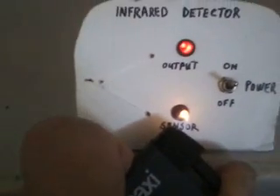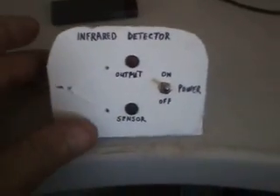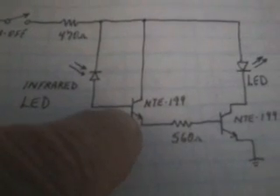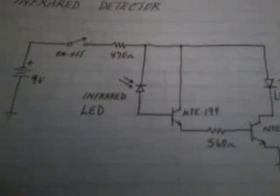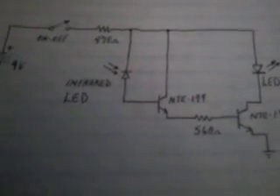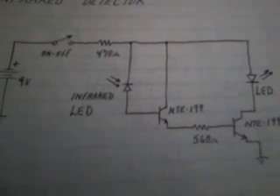I'm very, very close to the sensor, and you can see the light coming on. And there it goes out. So it actually even detects infrared light from a fire, but you have to get up very close. I can increase the sensitivity of this thing — I just have to put an amplifier between the infrared sensor and the base of the driver. But I don't want to, because this thing is sufficient enough to detect infrared light sources up to about five feet. That's all I need. I don't really want to detect fires — fires you can easily detect with your eyesight.